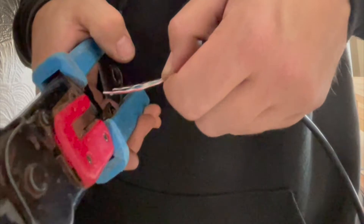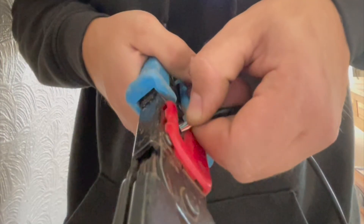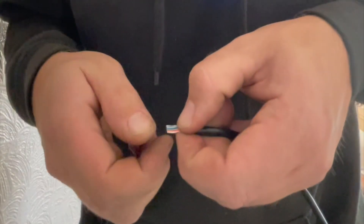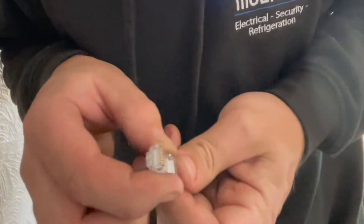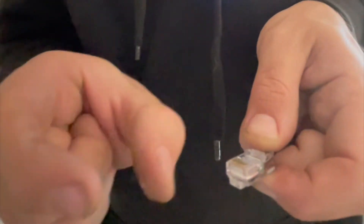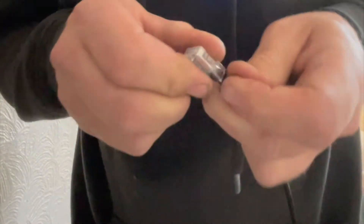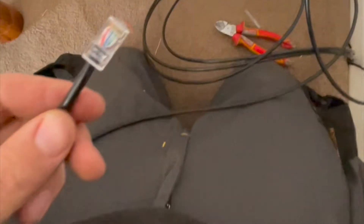Trim the excess off. The technique is to pull the wires tight with your fingers, keeping your finger and thumb tight where they come out the end of the cable. Squeeze them together, hold tight and give it a little wiggle with your other hand, gradually running your fingers back across the cables to straighten them out. Just make sure none of them cross over. Get your RJ45 and slide it onto the end, being careful to slide it down the little grooves inside. Hopefully they'll all be at the end of the cable. These aren't pass-through connectors — those are easier to fit, but we've got plenty of these in stock. Give it a push all the way in, crimp it so the little gold teeth go down into the cable, and the cable clamp on the back holds it nice and tight. Just got one more end to do.